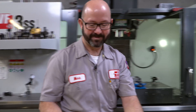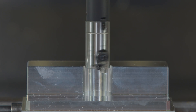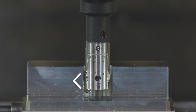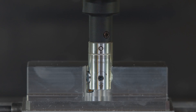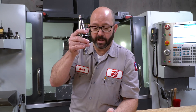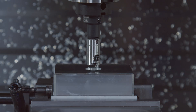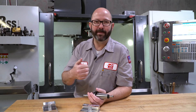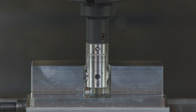For a normal boring operation, our tool is going to come into the spindle, start rotating, it's going to feed down, and then at the bottom of the hole it's going to orient itself and face most likely to the left. It's then going to stop and retract by a certain distance — that distance is defined by the Q value on our G76 line — and then it's going to retract up. We don't just use a reaming cycle that feeds down and feeds up, because giving it that kind of spring pass might leave a beautiful finish on the way down, but as it feeds back up it's just rubbing against the material and gives you a crummy surface finish. So we want to engage in the cut on the way down, retract, and then get out of dodge.